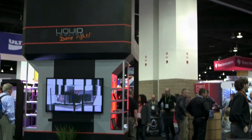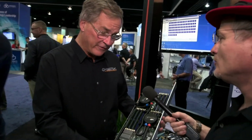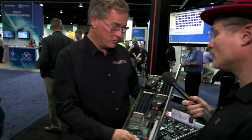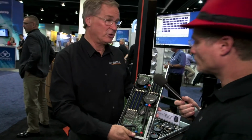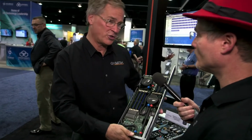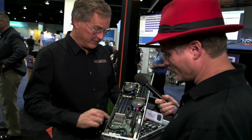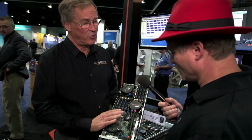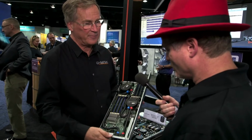Okay, so what kind of flow rate are we talking? Are we talking hundreds of gallons per minute? No, nothing like that, is it? No, very low flow and very low pressure. So about 35 liters per hour, which is a little bit over 35 quarts an hour for my American friends. And very low pressures, about 0.2 bar, which is about 3 or 4 psi.